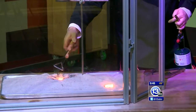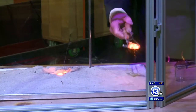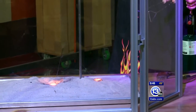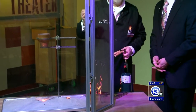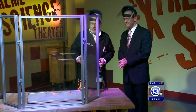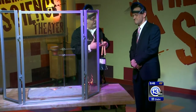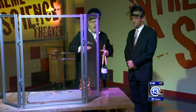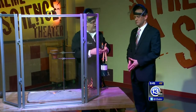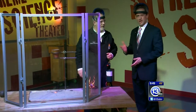It melted itself right through the sand to the base of our stand — can't even get it out. But it is in excess of 3,000 degrees, glowing red hot. We've created molten iron — that's incredible — simply by allowing that iron oxide and that aluminum to react together. And once you got it started, it just went on its own. It actually broke through the cardboard and dropped down, creating that little blob. What would you use this for? If you are a railroad and you've got lines that you need to join together, you can create — there's a whole process for this — a ceramic crucible that goes around two separated railroad tracks. You create molten iron, it fills in that gap, you cut off the excess, and now you've got one continuous railway. Does this qualify as metallurgy? Yeah, absolutely. Well, that's how you imagine it.